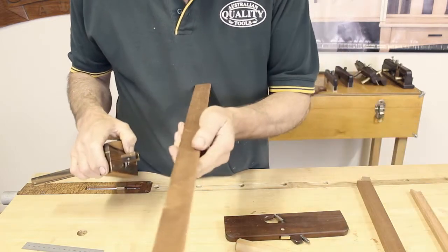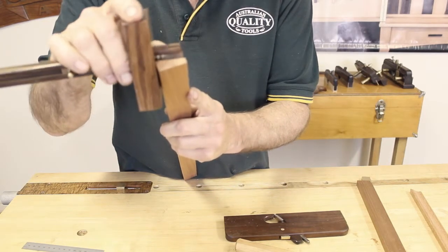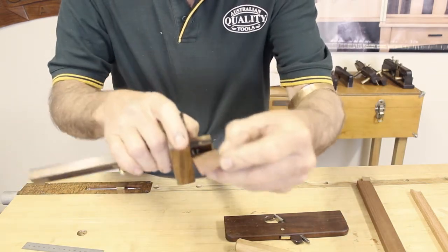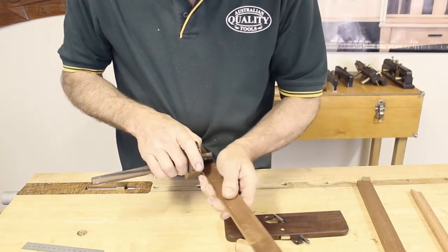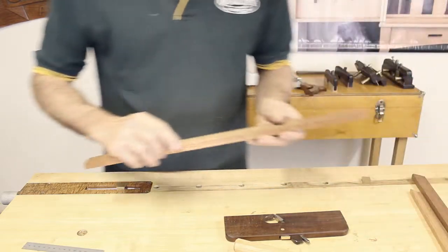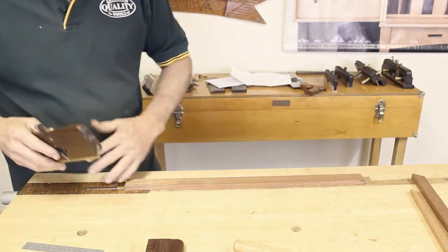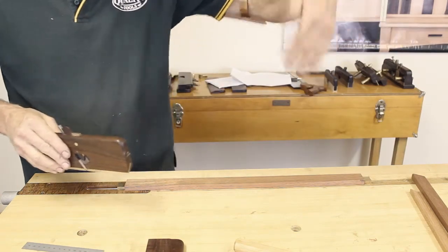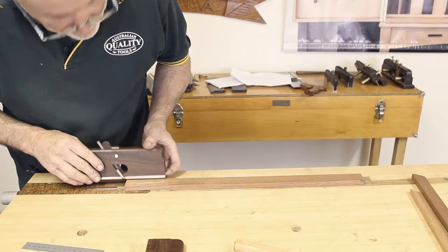While I'm at it I'm going to do the other 15-degree piece of wood. This is where it's a bit trickier with your cutting gauge because you haven't got that flat surface to run on — you've got to make sure your cutter is cutting into the wood nicely. If you do use this method you need to make sure your cutting gauge is not wandering off. Another consideration when making mouldings is the length of the piece of wood — if you want to make a frame then make the moulding longer so you can cut it and miter it out of one piece. If not you have to do it in sections, but that makes it harder to match the moulding.